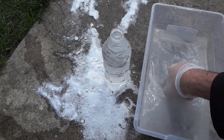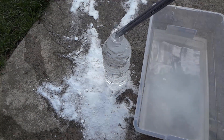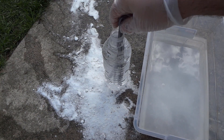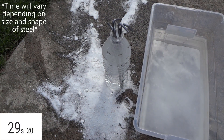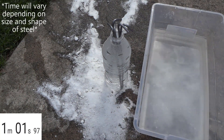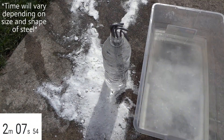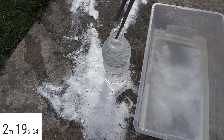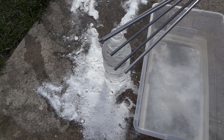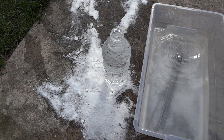There's still a galvanized section that wasn't submerged in the acid, so I'm just going to flip these and repeat the process. After two minutes, the bubbles stop flowing so aggressively, and the coating looks like it's completely off. I neutralize the steel again and set it aside.